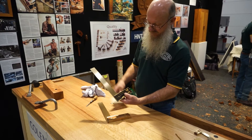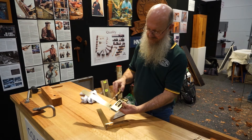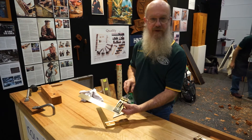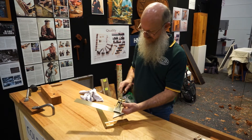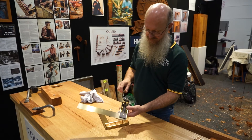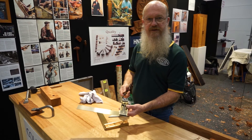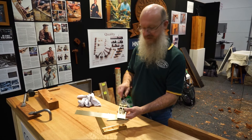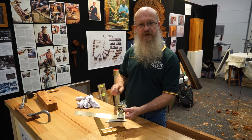I can find out where it's sitting by feel. The blade is actually in — the square is closed a little bit. If you think of the pivot pin: tightening the screw on this side will push it open, tightening the bottom one will close it. So we just need to nip that one up a little bit. Check the square again — now I'm getting very close. I'll tighten up a little bit more. If that screw gets really tight, you don't just keep going — back off the other screw a little bit. However, I would always finish setting the square by tightening a screw, not by loosening it.